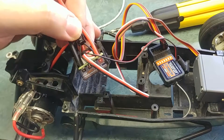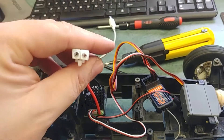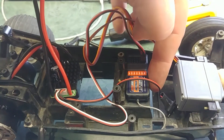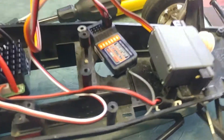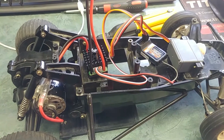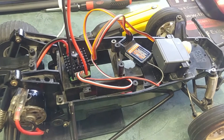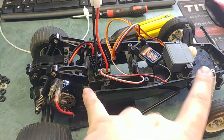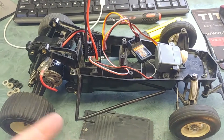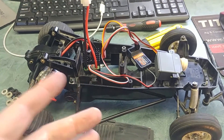With the servo in the front, I'm going to mount the speed controller in the back — just a Hobby King 45-amp brushed ESC, the TR6A version 2. That'll sit up there and leave me room to hopefully fit a regular-sized battery pack underneath. A lot of guys with old-school cars, because of that shorter hump pack, are running two-cell LiPos, which are a bit smaller than a six-cell 7.2V.